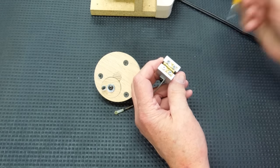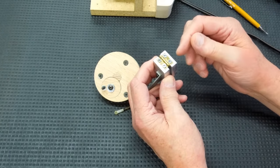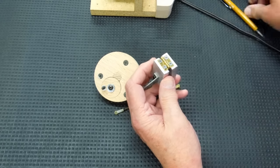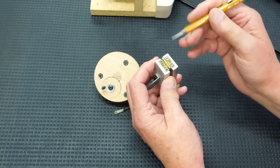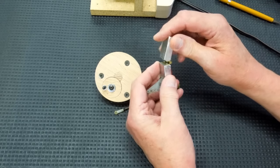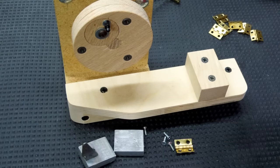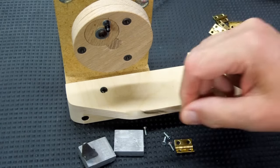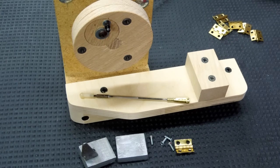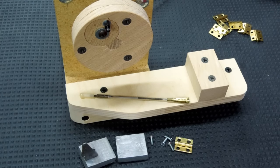And two aluminum blocks that I drilled and tapped 4-40 to hold the hinge. I chose not to use wood because I'm going to be bending and twisting on this to try and loosen up these hinges, and that would break out of a piece of wood pretty easily. None of this is new hardware — it came from crashed airplanes and leftover bits. To make this whole thing was probably three hours. The fact that I can do 480 cycles on a hinge in 10 minutes means I'm sure as heck not going to do that by hand.